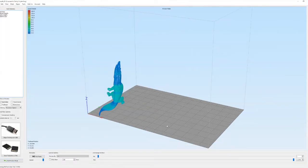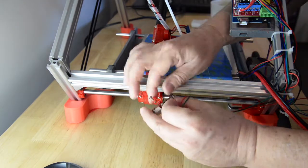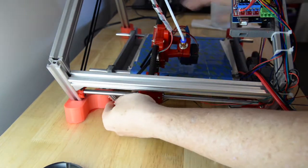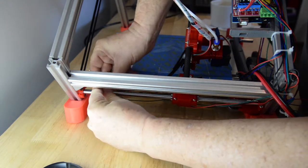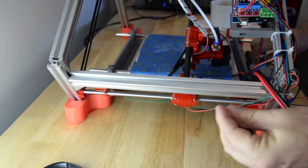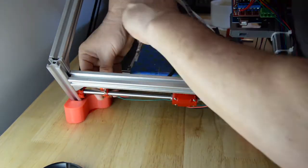You can see in the preview of the G-code in Simplify3D what I mean. So to rotate the X and Y I had to move my end stop from one side to the other side. I also had to swap my Y and X axis end stops.